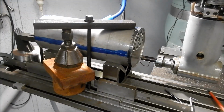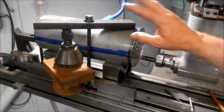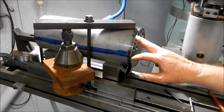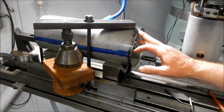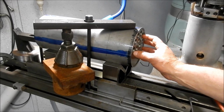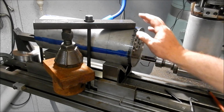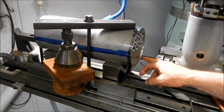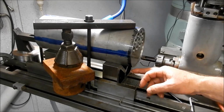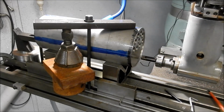I might just show you a quick little setup we're doing here at the moment. I just need to square up the ends of the barrel for Andy, so that he's got reference points that he can start setting up a lot of his plate work to. So I've got the tube plate at the smoke box end jammed up inside here. It's quite tight inside here with a clamp over the top. We've got a clamp at the back as well. And all I'm going to be doing is with the mill just traversing backwards and forwards until we get that face nicely squared up.